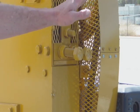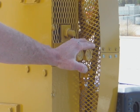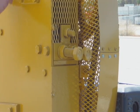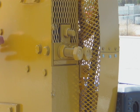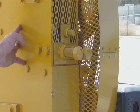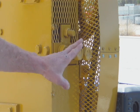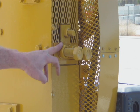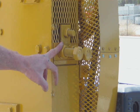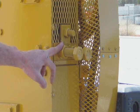On this side of the unit, you do have an adjustment here. These two 1-inch threaded rods adjust the position of your jaw. You run these in to decrease the amount of space between your stationary plate and your jaw plate. You want to make sure that these lock nuts are down tight during operation.